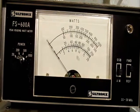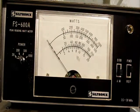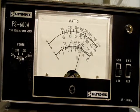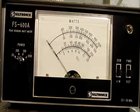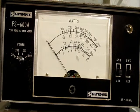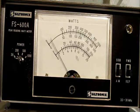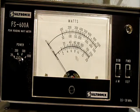That was the demonstration of the difference between single sideband and the AM signal. The other signal is the CW signal — that's what you set it at in the forward direction. Now let me flip it to reverse direction — the antenna and transmitter are matched, so there's very little deflection. I'll mismatch it a little bit so you can see that this is correct — there it goes back down, then back up.